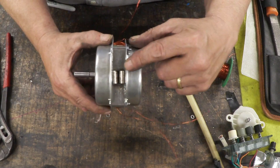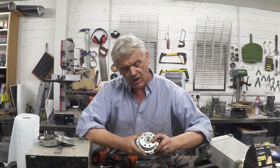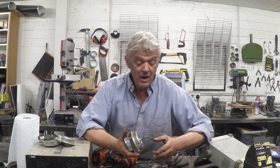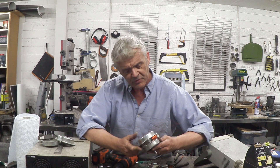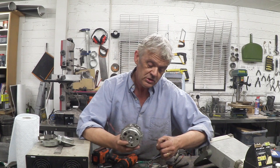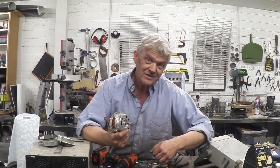And that's it back together. There are the magnets and there are the coils. These things are actually being touted as the ideal generator for wind turbines. Certainly if you look at the literature there's an awful lot of respect for these for so many reasons. They only have wear on the bearings so they're going to last an awful long time. They're extraordinarily cheap to make because they're made of very little more than pressed steel. The coils are easy to wind and they don't need connecting to a gearbox, which is pretty cool. Obviously the next thing to do is to get that into some kind of wind turbine and see what we're actually getting out of it.